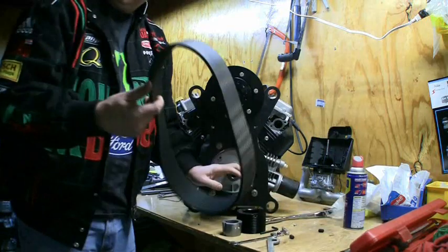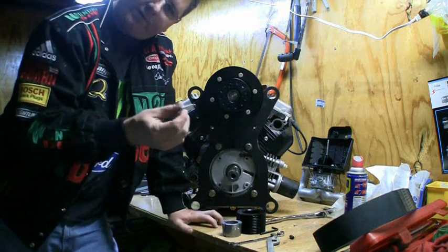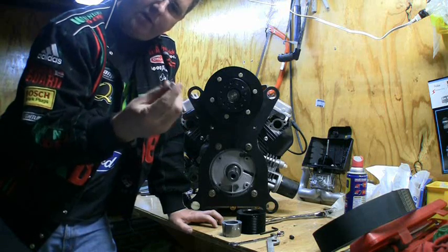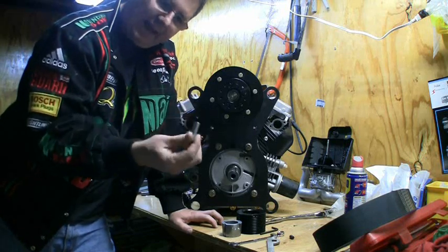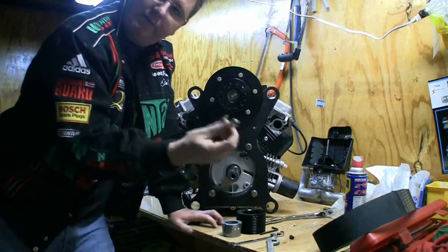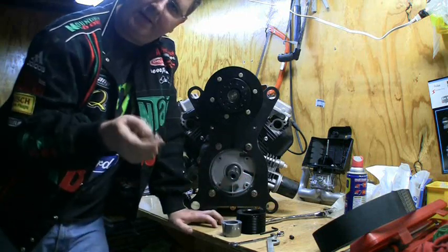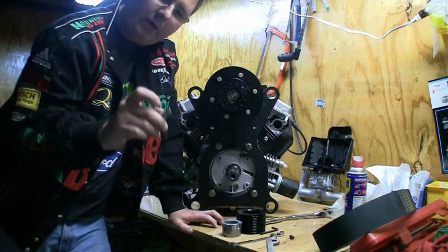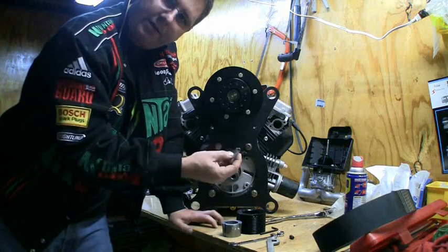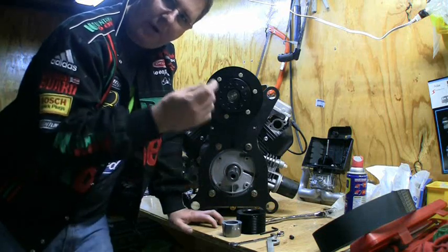We've got our belt. You have a keyway — ours is a little different from most. If you lose one, this is nothing more than 3-eighths key material, so you can find it anywhere. I like to sand it a little bit on both sides so that it pops down into the crank key relatively easily — not sloppy, but it should go on there. We weld a little tab on the back so that the key can never come out. Once this drive is assembled, this key cannot come off unless the drive completely comes apart, and we've never had that happen in three years.